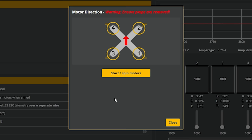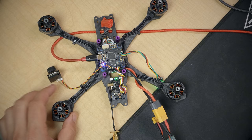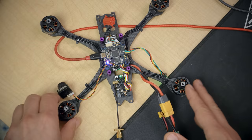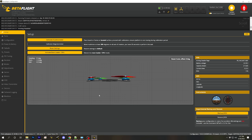There's one more basic check to make sure the flight controller and motors are in alignment, done in the Setup tab. We installed this flight controller with the forward-facing arrow not facing forward — we need to verify whether that's affecting the quadcopter by comparing the quad's real-world motion to the 3D model on screen. If I tip the quad to the right, the 3D model tips to the right; to the left, the 3D model tips to the left; tilt it back, the model tilts back; tilt forward, the model tilts forward. The yaw axis also moves correctly. It is moving 100% correctly.